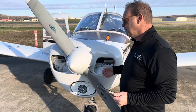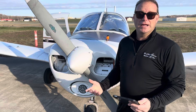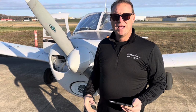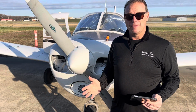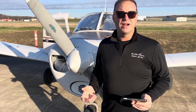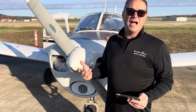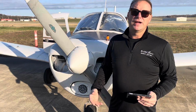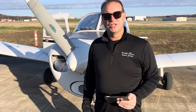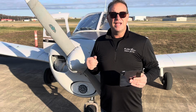Okay, now that's if it's off and it's too cold. Now what if it's on, it's been cold, and you pre-flight and you just don't take it off and the temperatures are going to be too warm? Once again, very, very big problem. Now you're not allowing the oil to cool. Oil temperature comes up, gets higher, overheats the engine. Same thing, catastrophic failure. That's a very high risk of catastrophic failure, and you're going to find yourself in a field, hopefully safely in a field doing an emergency, but you will be doing an emergency engine shutdown. And we don't want that, so this is a huge thing that is super important.